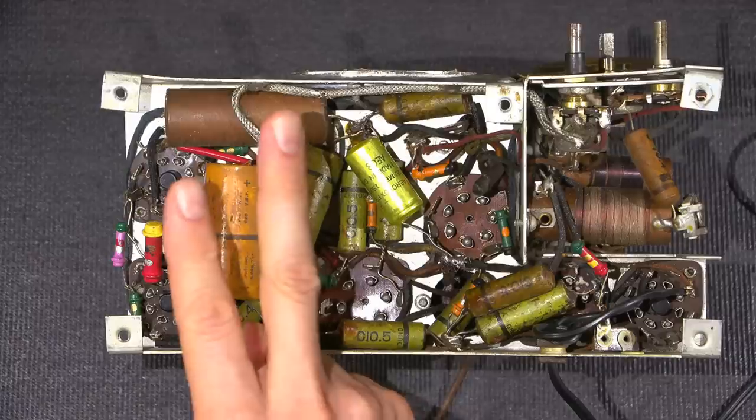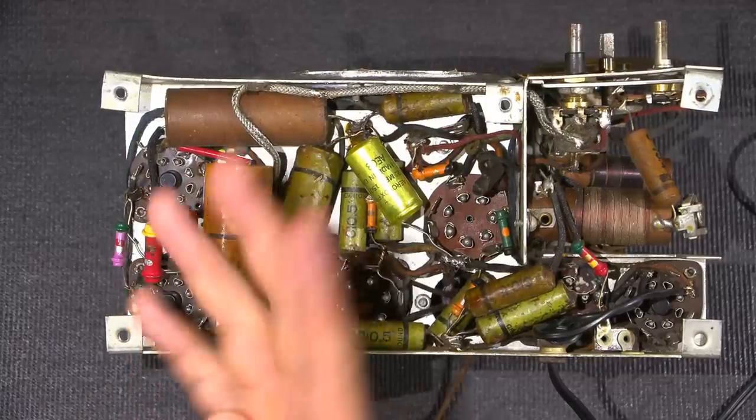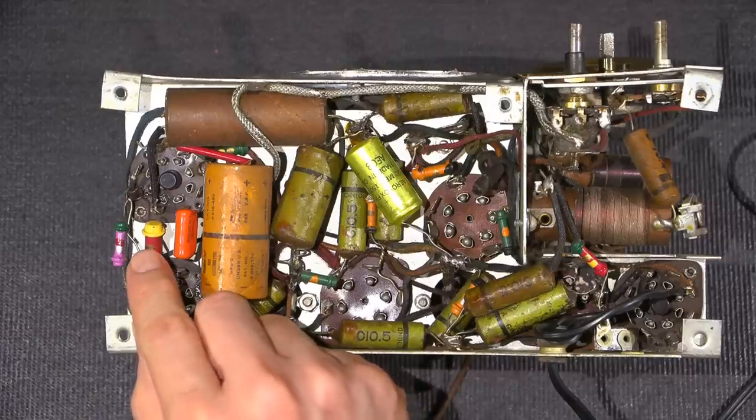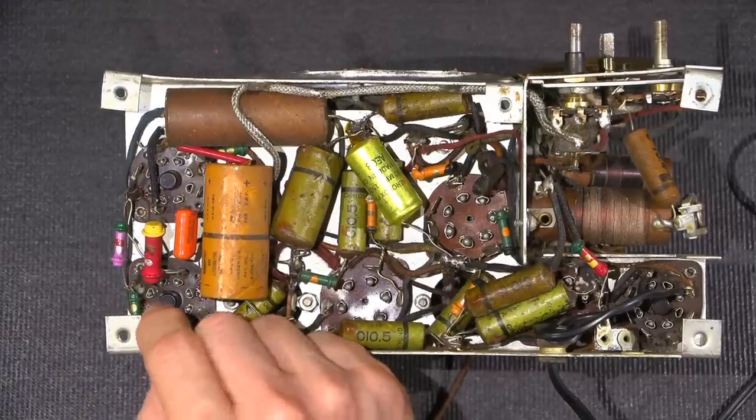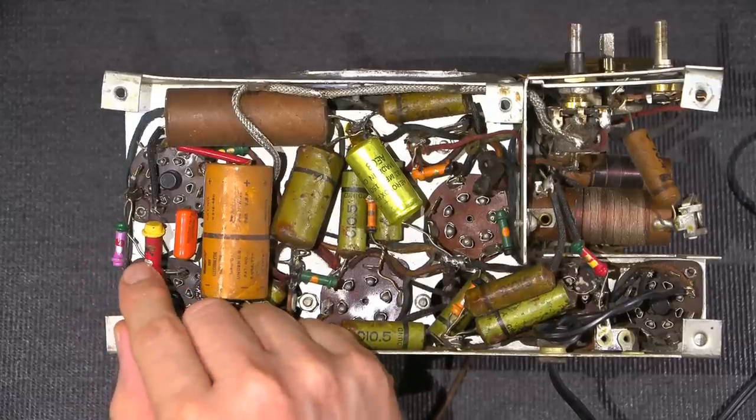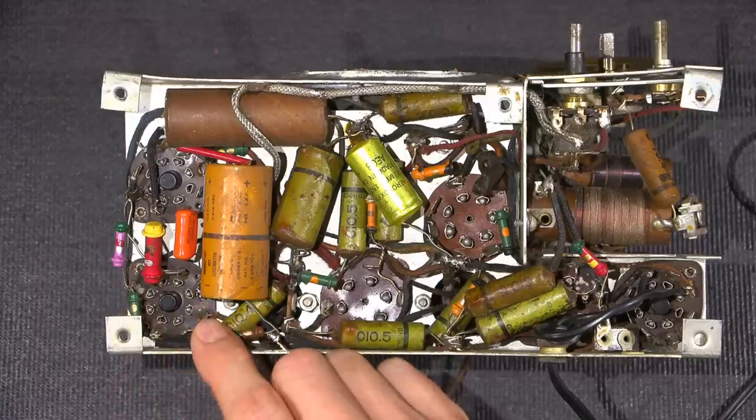Body is red, number 2. End is yellow, number 4. And then the dot is the number 1, which would be 240 ohms. They've taken the time to put the tolerance on these resistors as well. You can see silver here, so it's 10% tolerance.